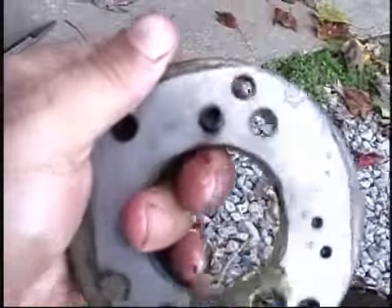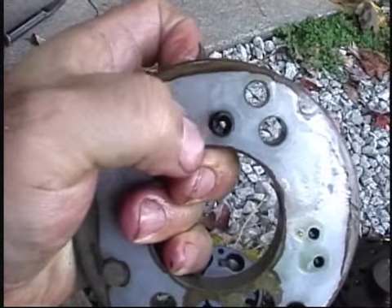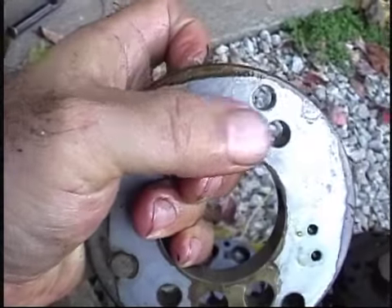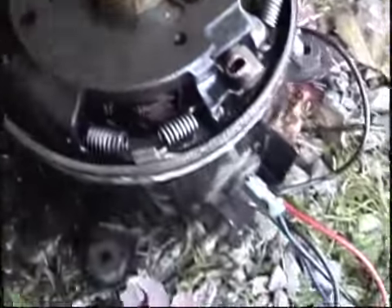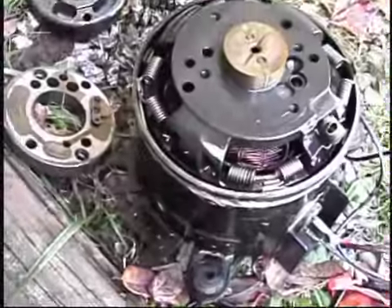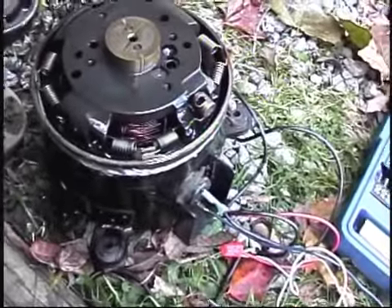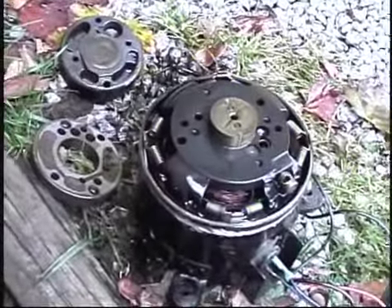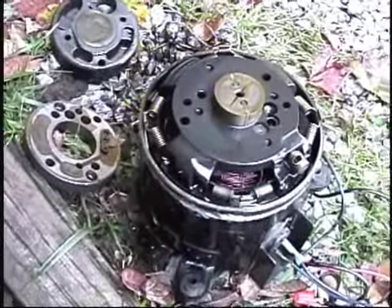I got the other ring off. Took out those two star bolts and I noticed this little port that comes up through there — it's almost completely blocked. And this is just locked. I have a feeling this compressor was on its way out even before I took it. I only ran it a couple of times and kept the lines off. I have an old Tecumseh compressor sitting in the cupboard that's been open to the elements for years and it starts up every time.